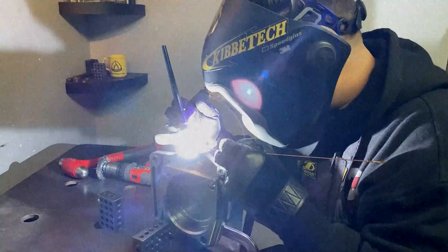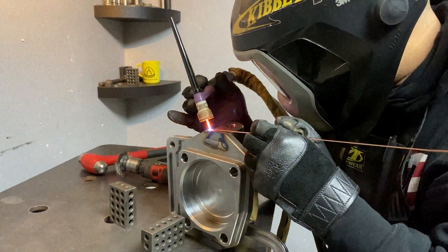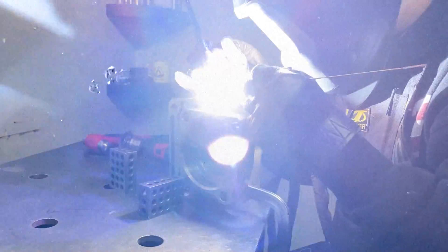So you got to lap weld the machined piece against the super thin piece — one inch thick to 20 thousandths thick — without blowing through. That was a tricky one. Plenty of clearance for the unit bearing. Just a couple pockets here and there to try to take some weight out of everything, even though it's fairly light and it's going on a big heavy truck anyway. Oh, it's beautiful.